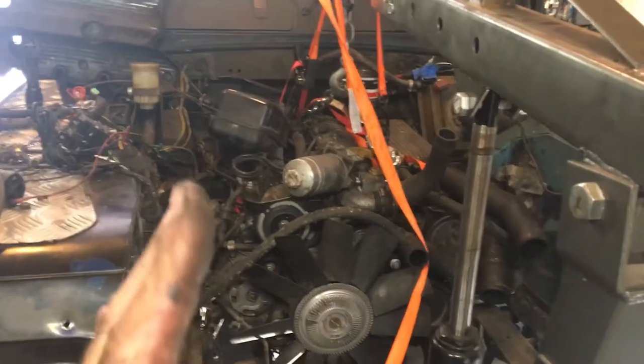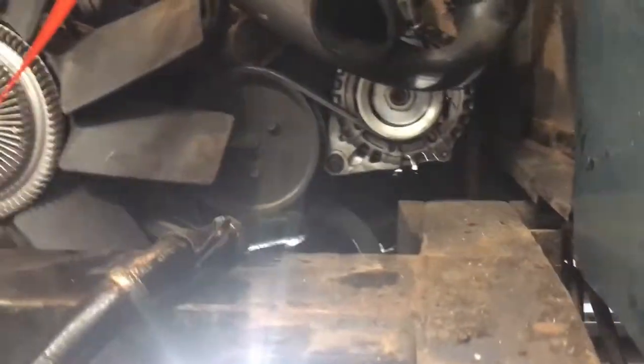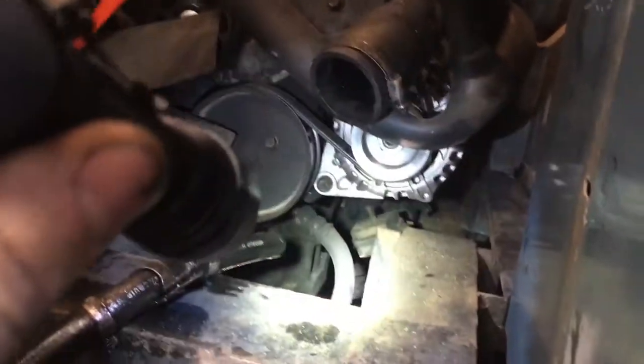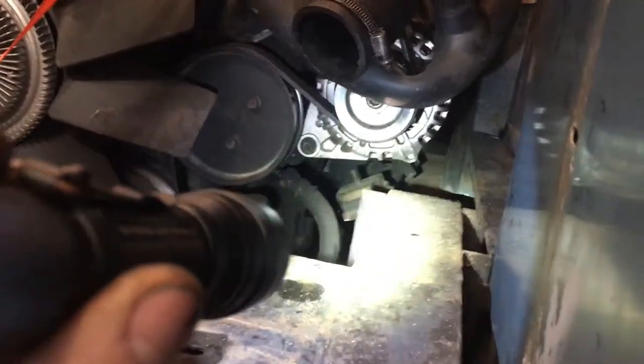Maybe this could have been avoided in your engine swap if you had the engine just over another quarter of an inch, but I can't do that with how I'm using my motor mounts because I'm already flush up against the bolts as close as I want to go. Also the reason I'm not doing one of the conversion kits is because I need the engine to sit at this height to have clearance. If I used the alternative mount — the motor mount off of the 110J — my understanding is it would sit a little bit too low. If it was set too low or any higher I'd be in trouble. So I like this position and my motor mounts are going to work.